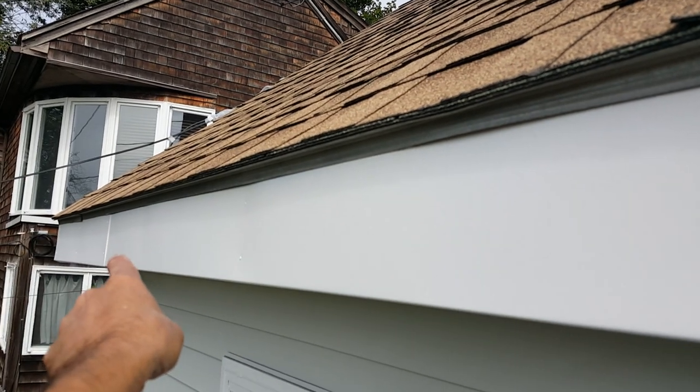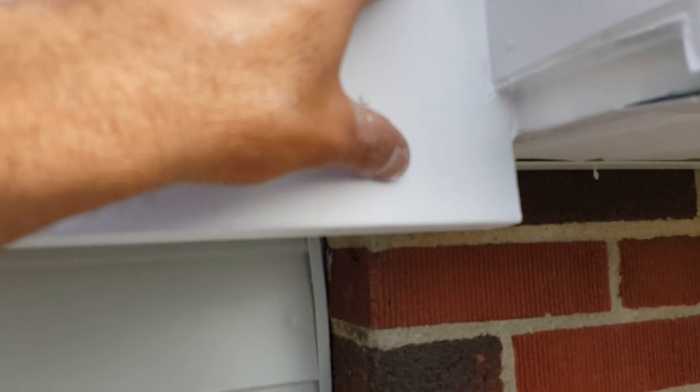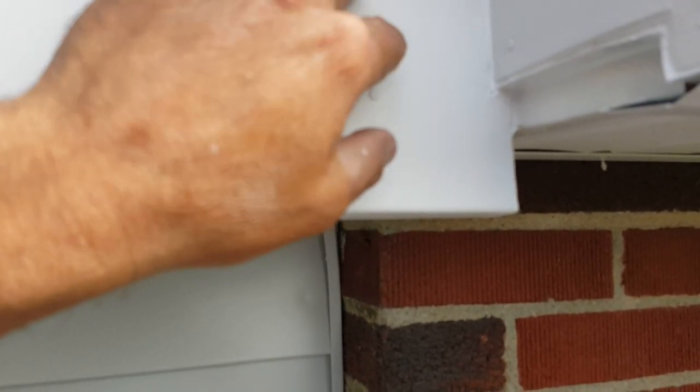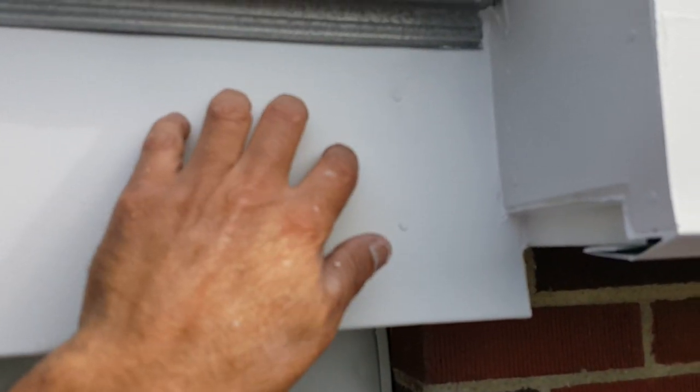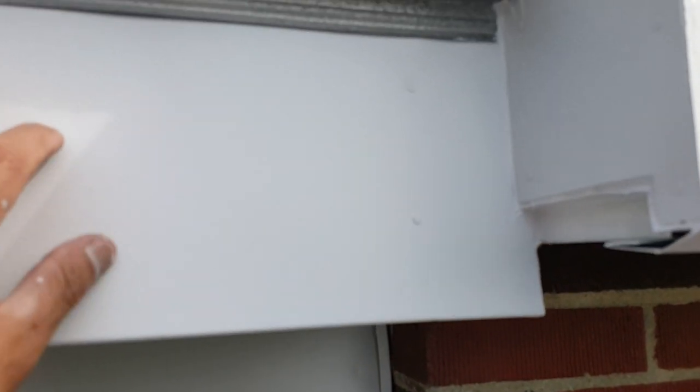We don't want to leave that like that. So I'm going to take my 2.5-inch sash brush, and I'm going to cut along this all the way to the end, and then I'm going to come back. I have a 4-inch roller, and it's a 1/4-inch nap, which is one of the thinnest. I could have gone 3/16, but I didn't want to go 3/16. 3/16 is probably a little too dry. I wanted to be able to put paint on and roll it back and forth and leave a little stipple, sort of like if it was sprayed. That's the effect that I'm wanting.